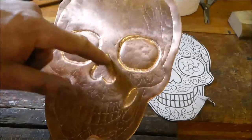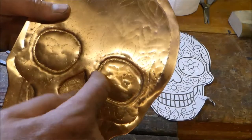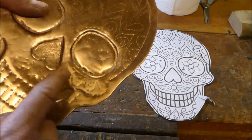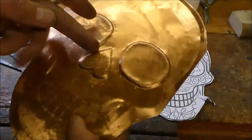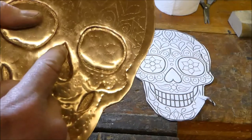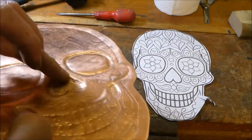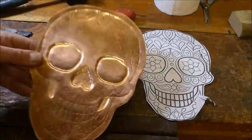At the moment I've done around the eyes, the nose, little bits of the back of the jaw. By working both sides - doing the edge down and then working and hitting in this way - it raises up the outside. So you can raise areas up: you hit down first, which kind of lifts this, then you go around the back and you hammer in, and that pushes the edge up. Then you hammer back down in here, which pushes it back down, and then it makes like a raised wall. So I'm going to keep on hammering and then start to pick up the design.